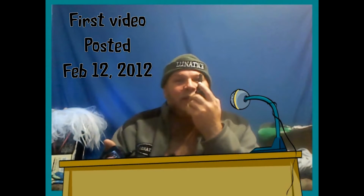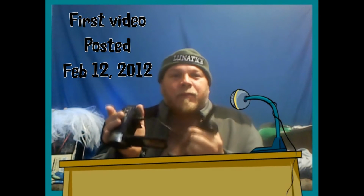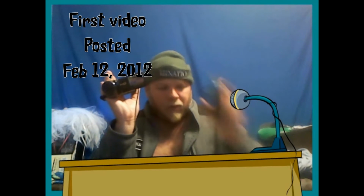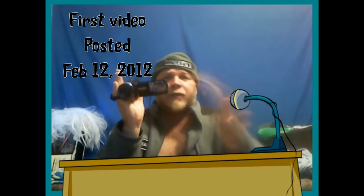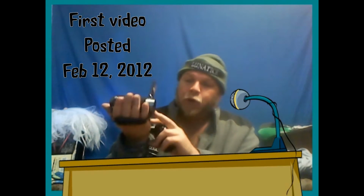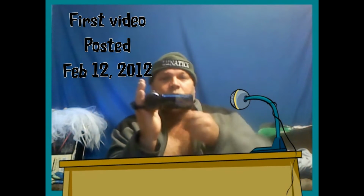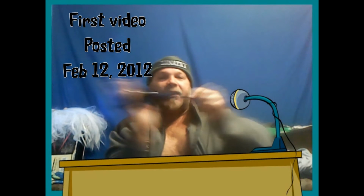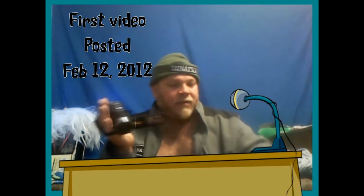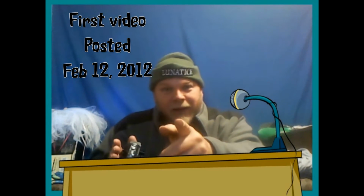Whenever you push your button down and talk, that is the only time that your camera is going to record audio. When you're not pushing the button on your transmitting handset, there's not going to be any audio picked up from your external microphones, or your built-in microphones on your camera. The only way you can get those microphones to activate again is to unplug that from the camera itself. Now, this has been tested, and I'm going to show you a test of it right here on Lunatic's channel.